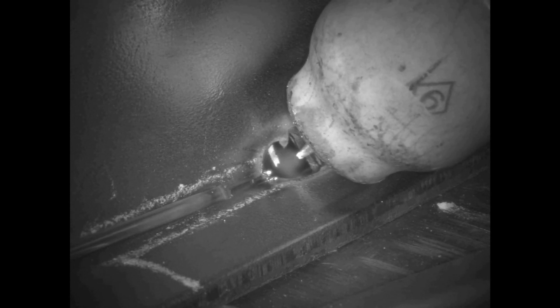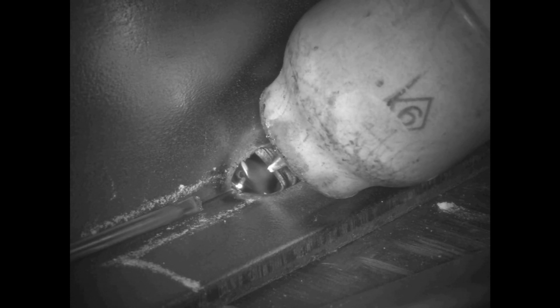We're going to go to the middle now. Starting the arc, getting it liquid, getting the width determined, and start dabbing. Just little circles to get it going to the proper width. Keep your filler metal on the front of the puddle, letting it draw off what it wants. As it swells up, move it over — dip, swells up, move it over. You want to keep the legs as equal as you can, basically a triangle. Let your post purge hit.